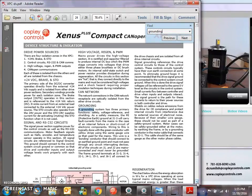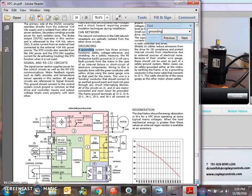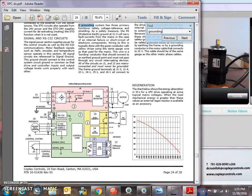I do like to talk about cabling, grounding, and shielding. So just make sure you've got earth to the case. The motor case finds a path to earth. There's an earth ground here, but when you bolt it in, it should find a path to earth. It's good to have earth at 24 volts, earth at the controller. The feedback shield absolutely must find a path to earth. Protective earth comes in with AC power. That's a good idea.